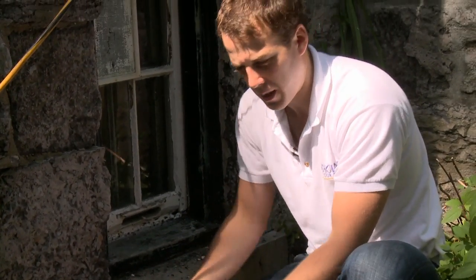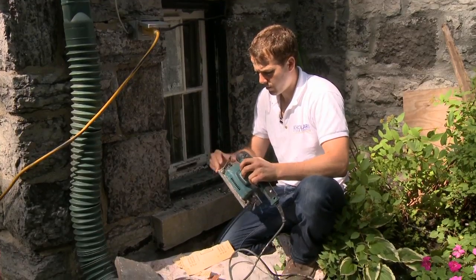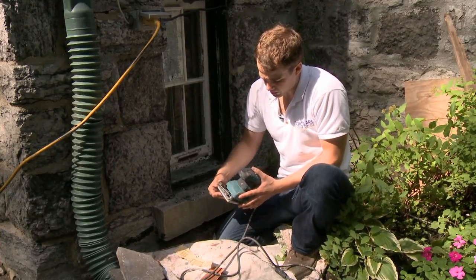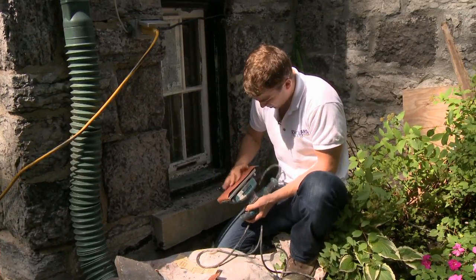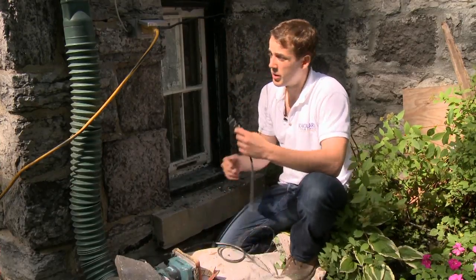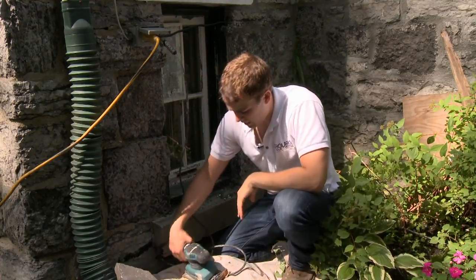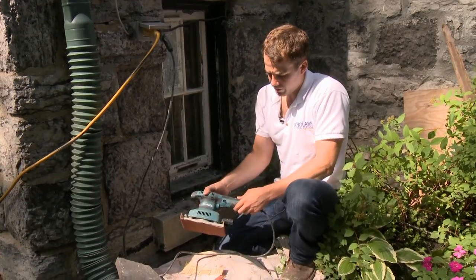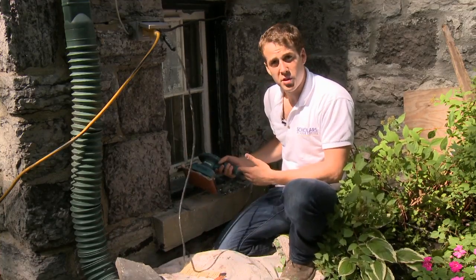Normally this sandpaper will just tear away. This piece is a little bit wet, but the electric sander will be one of your best friends all summer. To set it up: undo the clip, take your sandpaper, slide it in, close the first clip, fold it around to the other side, fold it under, and close the second clip. I happen to be painting near an electrical outlet, but often you'll have extension cords on site. There's also a lock button — if you hold it, it keeps the sander running, which is useful for sanding a deck. To release it, just click it again.